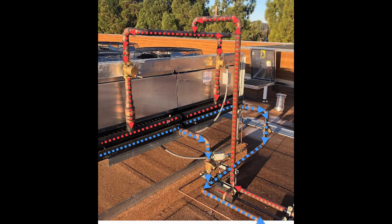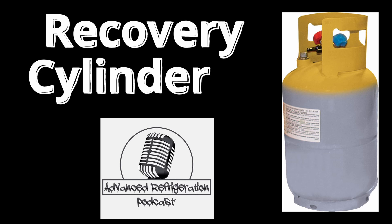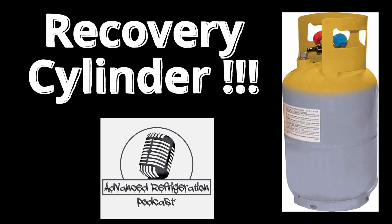How do you get rid of said non-condensibles? There are two ways. You could pull the entire charge, pull a vacuum, and charge it back as a liquid — it takes time. Or you could vent it off into a recovery tank several times.